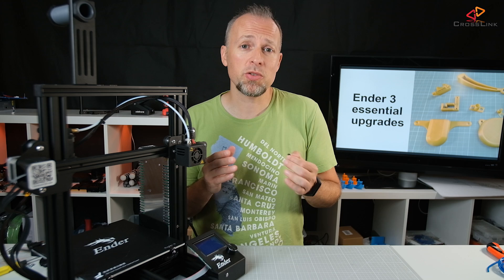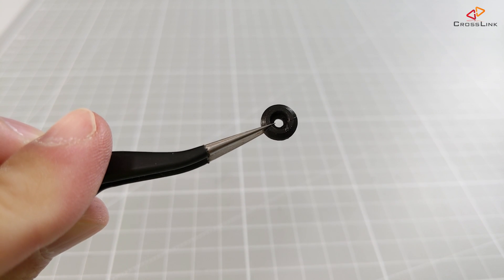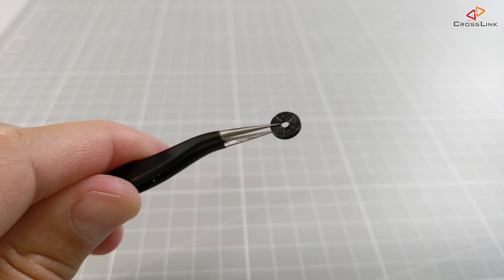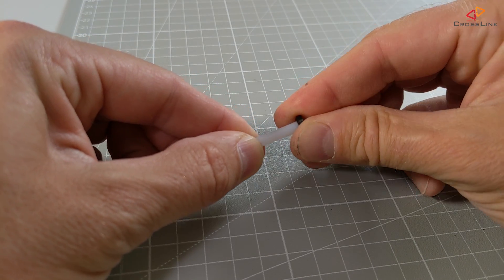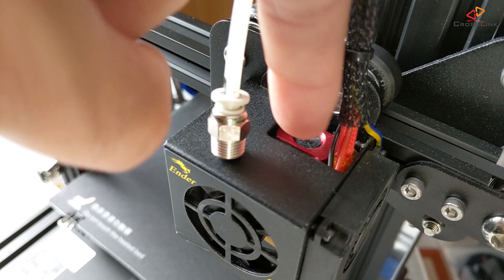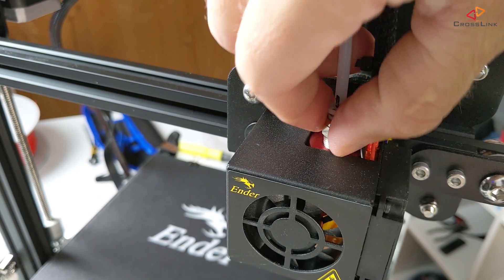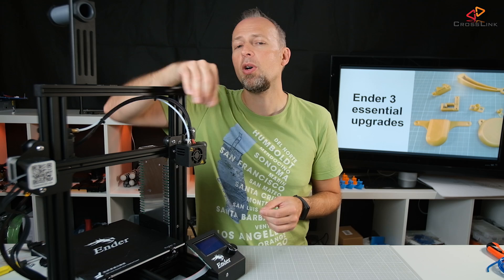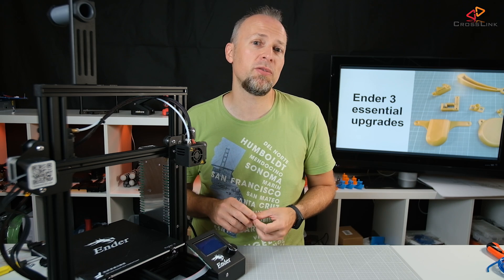This issue is easily fixed by the most important and simple upgrade that you should install on day one when you get this printer. This little piece of plastic has helped me the most to get reliable prints, especially when printing for an extended amount of time like 10-plus hours. The PTFE tube will be cut and a little piece of plastic is inserted on top of the PTFE tube. That part stays inside of the extruder, independent from the upper part. The lower part of the PTFE tube is pushed down by the fitting to keep it against the throat of the nozzle. If the upper PTFE tube moves or even loosens a bit, it's not an issue because the insert still pushes down the lower PTFE tube.